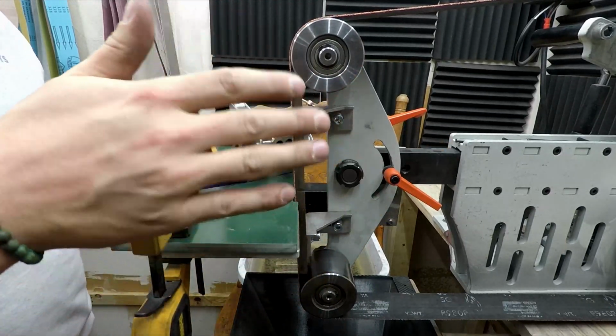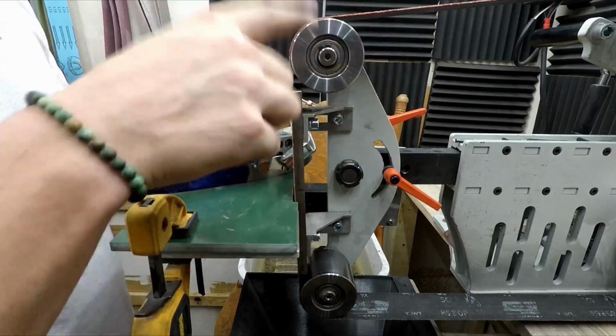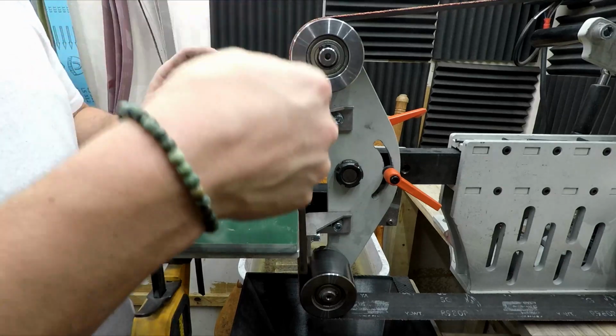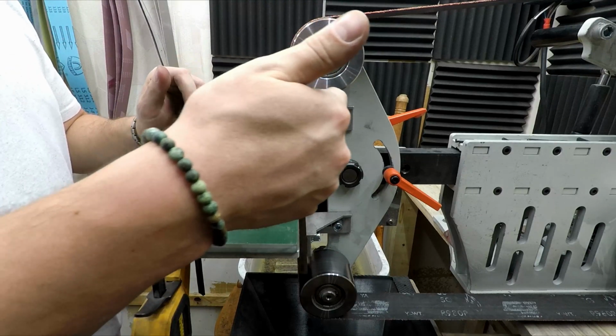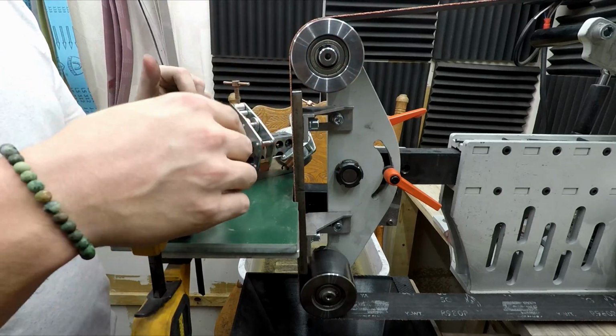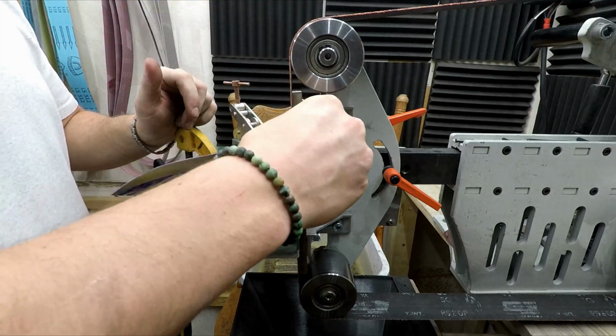I realized pretty quickly that my heating problem might actually have been my mistake. I took everything apart to take measurements, and when I put it back together, I put the platen flush with the wheels. I did have it sitting out a little proud. I'd heard from a few makers that this is a good idea to make sure that the belt stays flat, but I think for me, that was just generating a lot of friction between the belt and the platen.